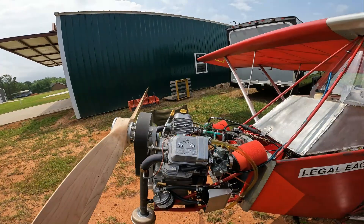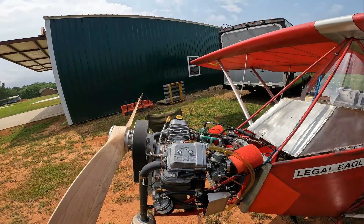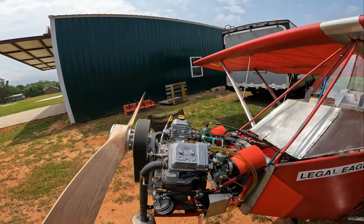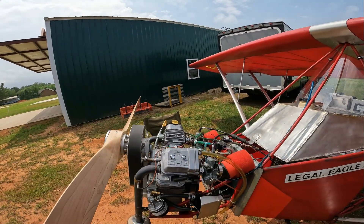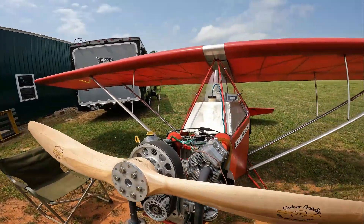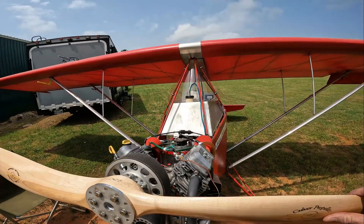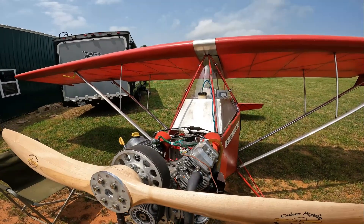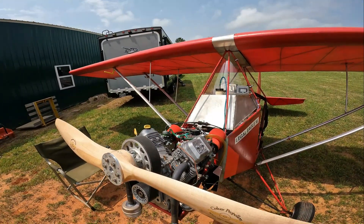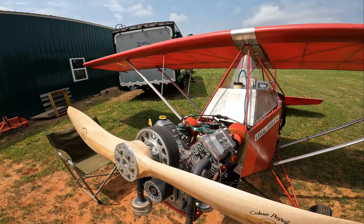I have a friend who recently flew this and put a little over three hours on it. He weighs 100 pounds less than I do. His climb rates were twice what mine are — the airspeeds weren't that much different, but the climb rate was about twice what I'm seeing. The most I've seen out of this is about 350 fpm with this prop. He saw as high as 700, though not necessarily 700 sustained. With the Verner on this airplane, I saw as high as about 550.